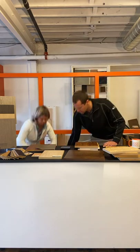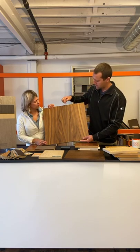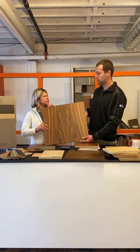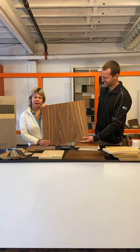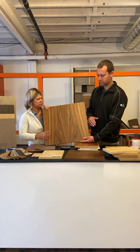There are a few different types of ways that the veneer is peeled. Rotary cut, meaning it's a whole piece covering that 4x8 sheet of plywood, or you can cut it into different flitches and achieve different looks, like plain sawn book match or slip match. This is an example of some walnut — you can see the flitch line right here, and on either side of the flitch line you've got a mirror image of each other. That is a book match, because it opens up like a book.